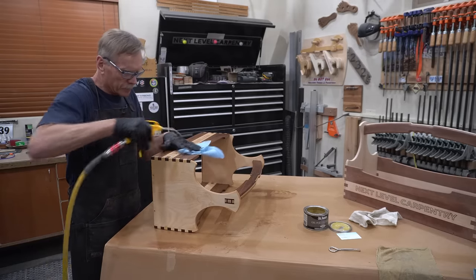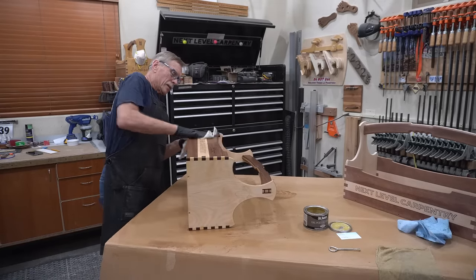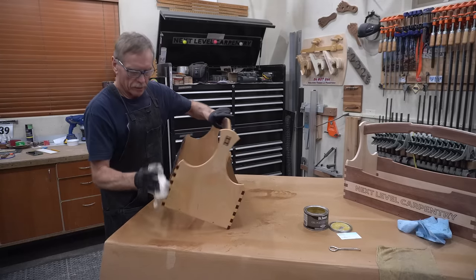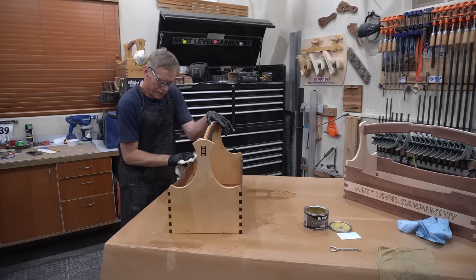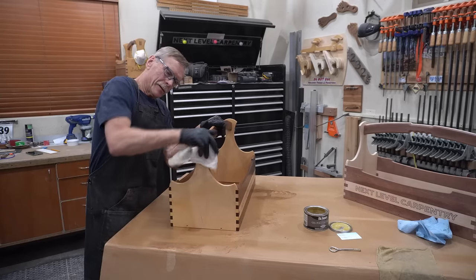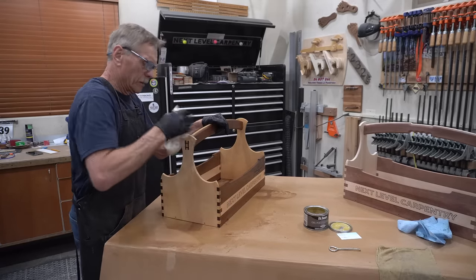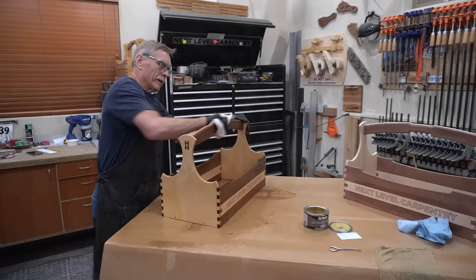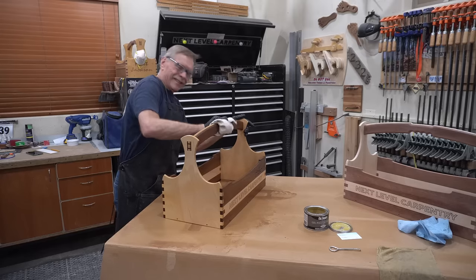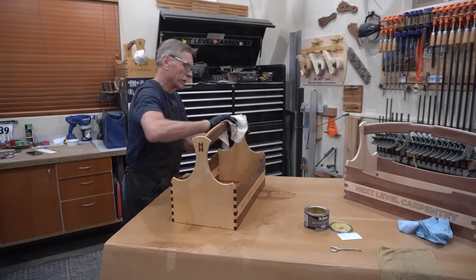And there it is. I suppose I've spent a long 15 minutes on this varnishing process, finishing up there by blowing varnish out of the engraving and some of the nicks and crannies in the corners. But other than that, all I need to do is give everything a once over with this soft cotton cloth. And ironically, once the finish is all wiped off, it's done. And that's because the finish is soaking into the wood, not laying on the wood.